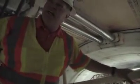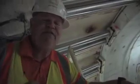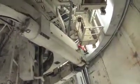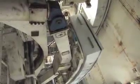What we just did is we stopped digging the tunnel, and the cutter head is stopped. We're not taking any spoils out, and we're getting ready to put in segments in a new ring right above you. These are the thrust cylinders. We're going to be building part of the tunnel, and we're moving forward. This is all done by vacuum suction. Each one of these segments has a vacuum suction on it. This machine puts it in place. As you're going to see, we take this segment up, move the thrust cylinders forward, put the segment in place, and then complete that with the other 8 segments.